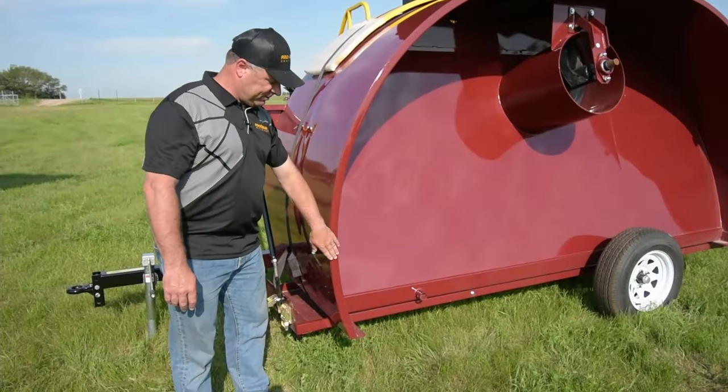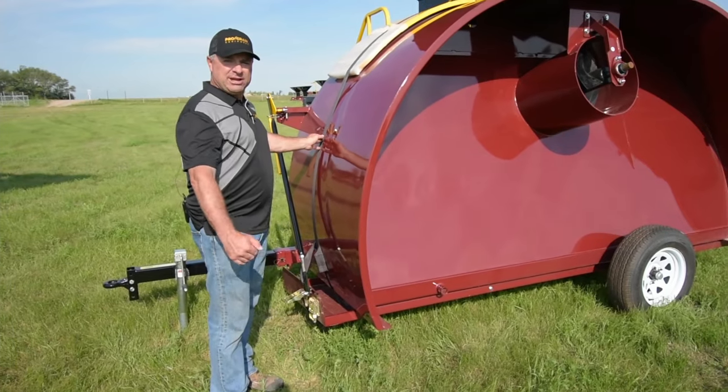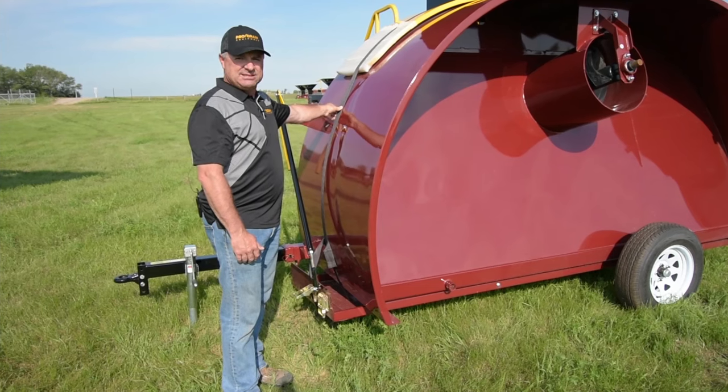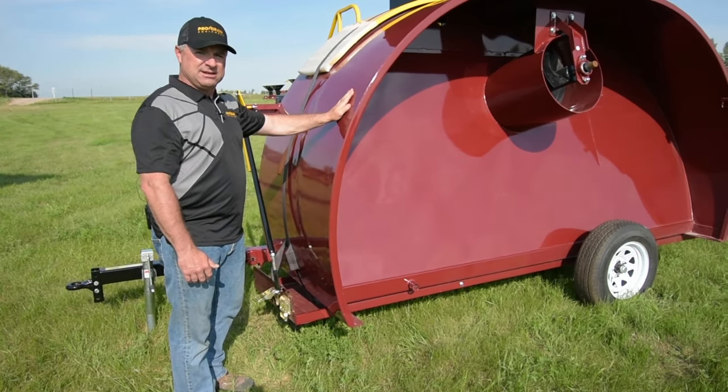The continuous curve or shape of our tunnel assists with keeping grain from leaking by — it eliminates that. We run our straps tight enough so the grain doesn't slide by but loose enough to let one ply of plastic come off at a time.